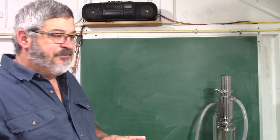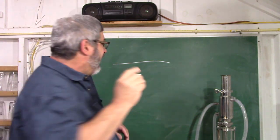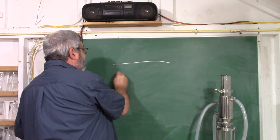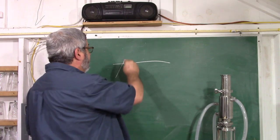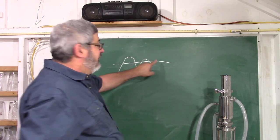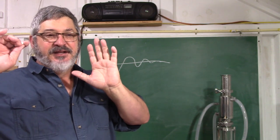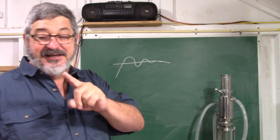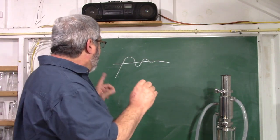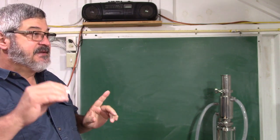Number two is a PID controller. The short answer is: the PID will rise the temperature up, it's going to overshoot the set point, then undershoot, then overshoot again — and then it will learn itself to get right to that set point. It does it all internally. That is the very short answer to a long question.